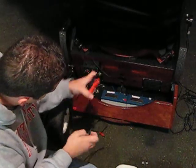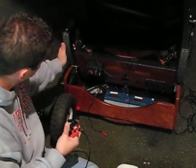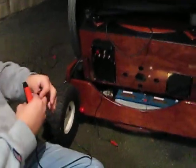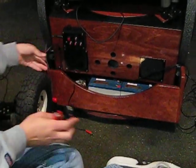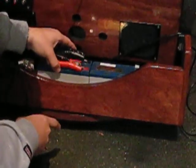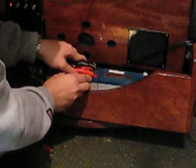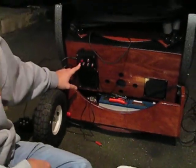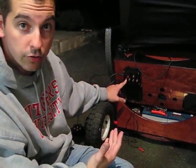What I usually do is take the RCA jack and plug it in first to your junction box — this guy here. This plugs into the side of the box. Then it's color-coded, so the red goes on the red and the black goes on the black. Once it gets plugged in, this little red LED comes on, which means power is being brought into the box.